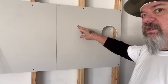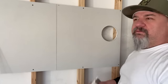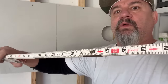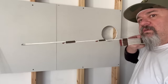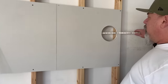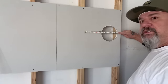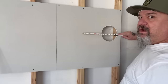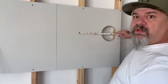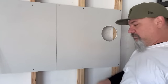Let's drill on the opposite side of the other stud. I've got what they call an old man rule — a rigid tape measure. You can hold it out and take your measurements; it doesn't bend like a regular tape measure. I stick it in there, and to the edge of my hole I've got 13 inches. So I know 13 inches is the face of my stud. I put a mark there, then go an inch and a half because studs are an inch and a half thick — they're not two by fours, they're an inch and a half by three and a half. I put another mark and I know I'm close to the edge of the other stud. Now I'm going to drill that one out.